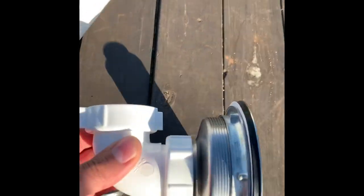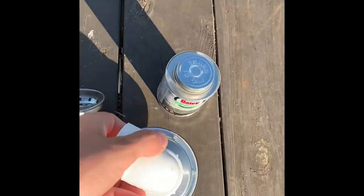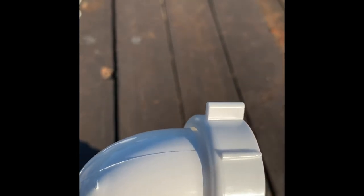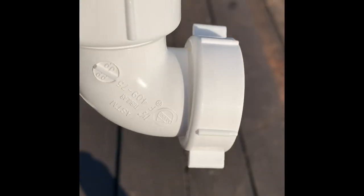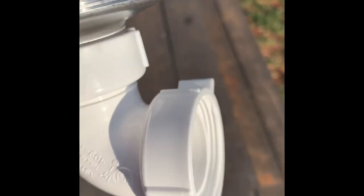When it's put on there, it comes off this. You'll drill a 3.5-inch hole in the bottom of the pool. And then I'm gonna put a layer of silicone on top of the pool, set this on top, then you'll put your rubber washer, paper washer, lock nut on the bottom. Tighten that down real tight. This will come off from the bottom, and then this bottom connection piece here will tie in directly to this